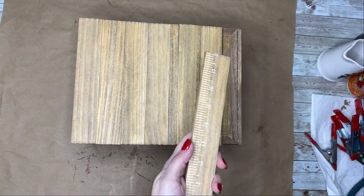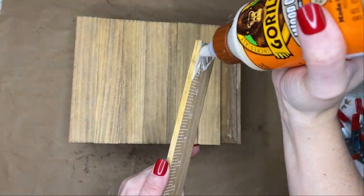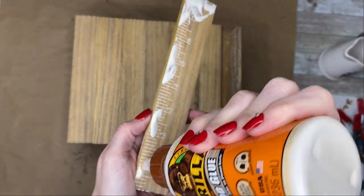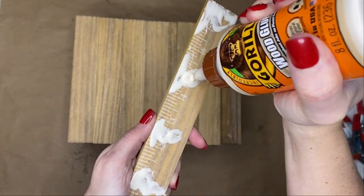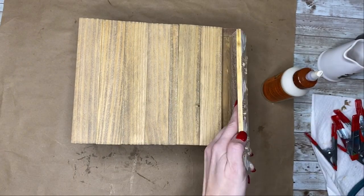And then when I get done, they lined up at the top. On the back here, I just laid those out like I did the sides. I measured them and drew them out with a pencil, and then I took them out to my chop saw and cut them off.